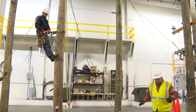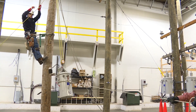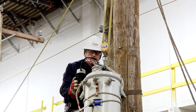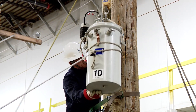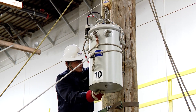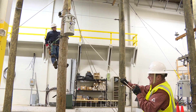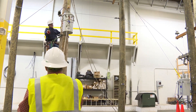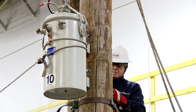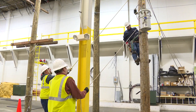I'll take the transformer up. Coming up on the transformer. I got the tag line. Notice Ronnie's getting into a good work position on the backside of the pole. He's using a screwdriver to pry the bolt out to him. He's tightening the nuts down by hand, getting all the slack out by hand, squaring the washers.